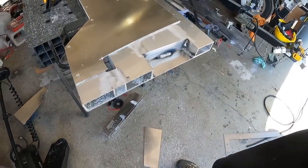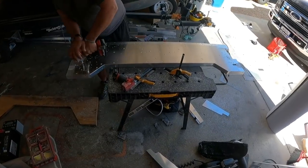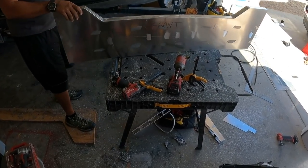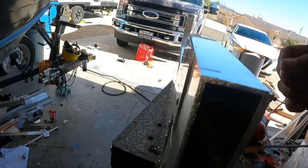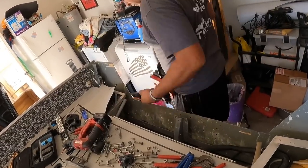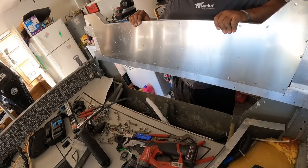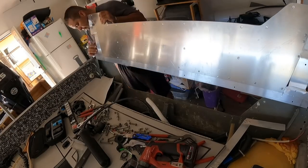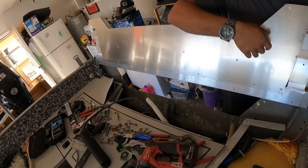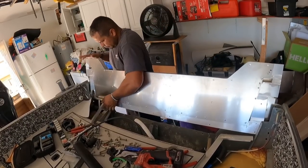We're going to make a few more holes. We attach this sheet metal — no big deal. Because we cut all the spots where it would have to be flush and it's going to sit inside those channels, we're using standard panhead rivets which are going to be stronger overall. Here it is, ready to get dropped in. You really want to clean that transom out thoroughly — there's all kinds of crap and corrosion and stuck pieces. Get all the extra stuck wood out because when you try and put this transom in it's going to fit tight, and you don't want anything in there hindering that. This is going to fit maybe much tighter than a wood transom, but we're going to get it in — we have no choice, it's going in.